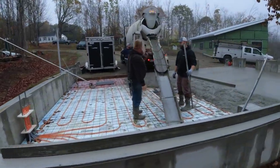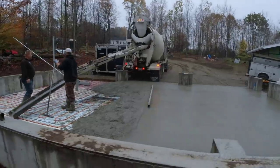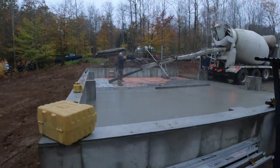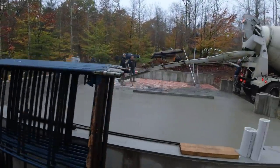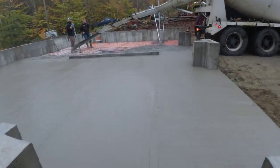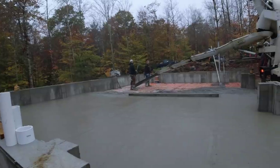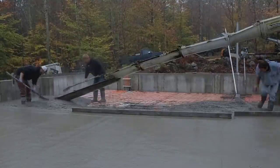After the first truck's dump, I was feeling pretty comfortable — you can see halfway through the door was about halfway, so we were a little over halfway with that first truck. It's looking pretty good as far as the concrete goes — we're not going to run out. What we'll do is get the second truck mixed up, dump out about 90% of it just to make sure we have enough. That way if we did think we were going to run out, we'd order the balance and have that first truck bring it back — we'd let the batch man know just as soon as we knew.